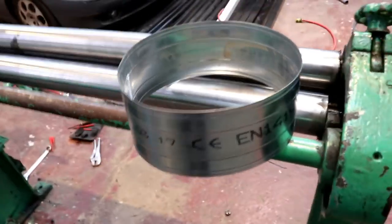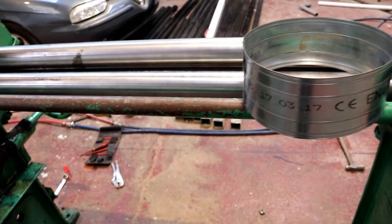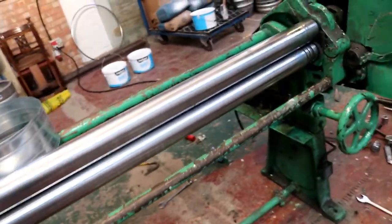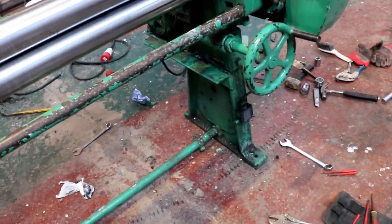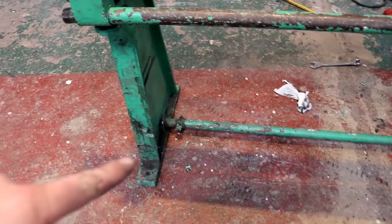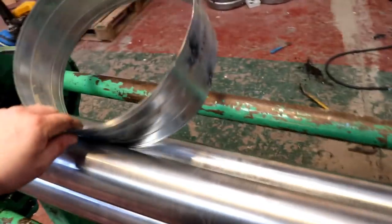I am going to have to learn how to use it though, because when you put the brake on it winds down, so it's got an extra two or three inches of sheet material — you can't just whack it into reverse for obvious reasons. I also need to get some wire for the emergency foot brake, because they put some electrical cable on it and it snapped straight away. I need a bit of stainless steel wire rope from there to there — if you get your finger trapped and can't reach the stop button, you just stamp on the wire and it turns the machine off. I've tested the brake, it does work. We're getting closer.